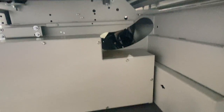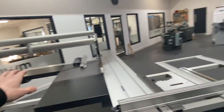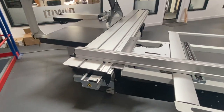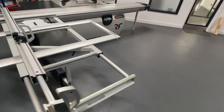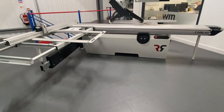The second extraction outlet is underneath the chip flap. You can see it's on the 20-degree angle — that port is 120mm and the guard on the arm is 100mm. Any extractor with 1,900–2,000 CFM will be good enough for this machine.